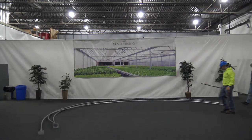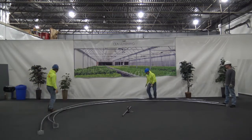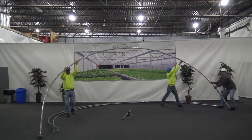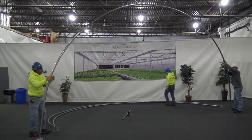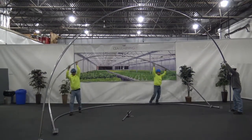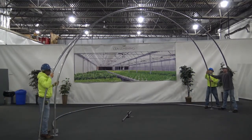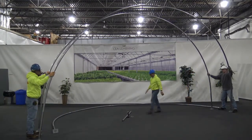With the help of a third person, lift the first two rafters into place. Have them hold the rafter as you secure the topmost purlin into place. There are different clamps for different locations on the building. End clamps provide a flush end. Your directions for your particular building will provide exact details of their location for your building.